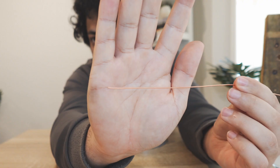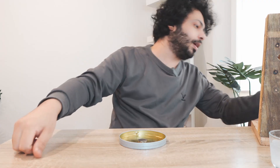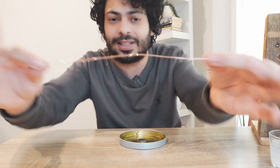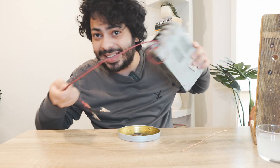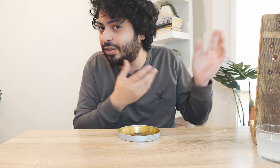This copper wire is quite thick — I got it from some heavy gauge electrical wire. But you can use normal thin stranded wire and just twirl it together so you have a relatively thick bit of copper wire. It's important that it's copper because it has to be non-magnetic. Lastly, we're going to use a power supply to get our DC current, but you can just use a battery. Faraday used a battery — I'm only putting in 12 volts, and you can probably get away with less.